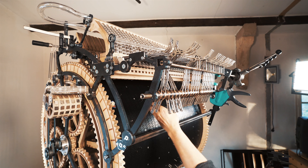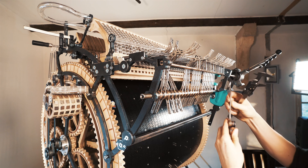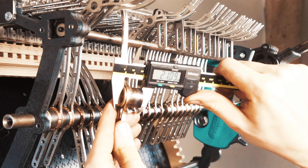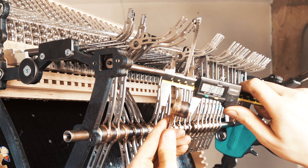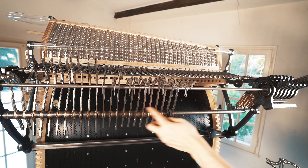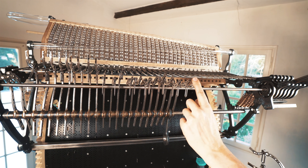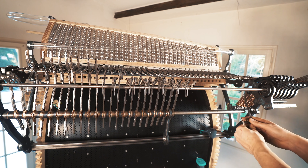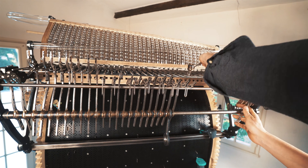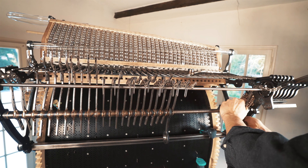The spacing on the whole marble machine between each two channels is 21 millimeters — marble divider, 21 millimeters. This should be 21. That's impressive. So this support comes after 22 pivots, because all these pivots are going to the vibraphone. This is for the kick drum — one channel. The next 24 is the second channel for the kick drum. If you've been following along, you know that we're doubling up the channels, just like a drummer can use two hands to play on the snare drum. The Marble Machine X can use two channels to play on the kick drum.